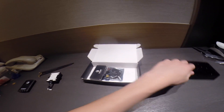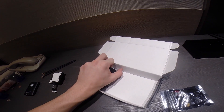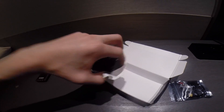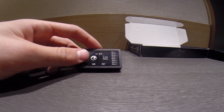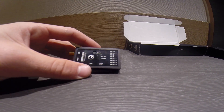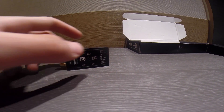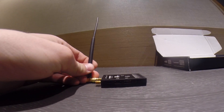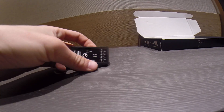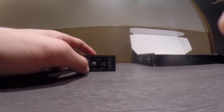Let's put those off to the side. Underneath the facing, there's a bag of goodies, and of course the receiver. This is an eight-channel receiver that can also do PPM, so you can mix in more than eight channels. It's got the bind button, antennas, and receiver — looks similar to your common Easy UHF receiver, except this thing has got a lot more packed into it.